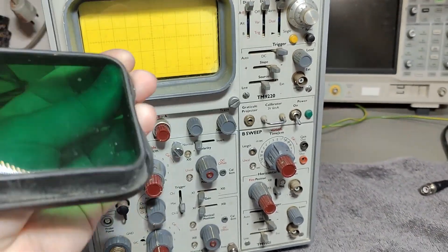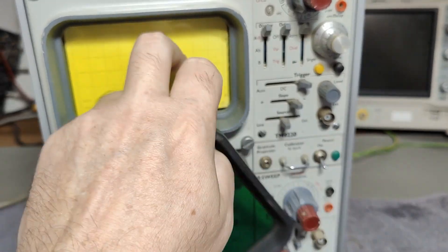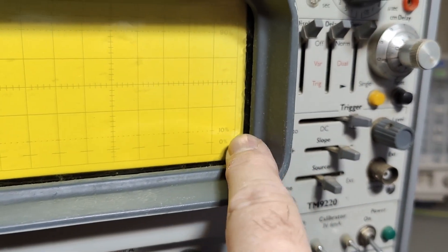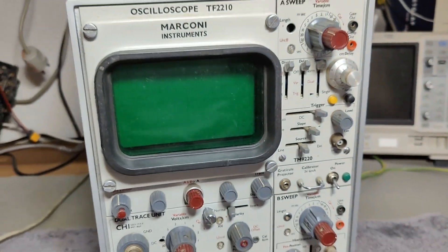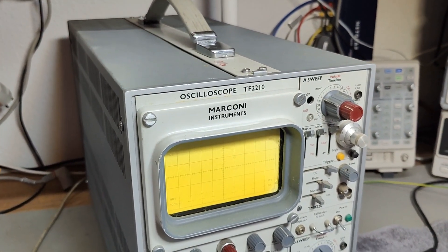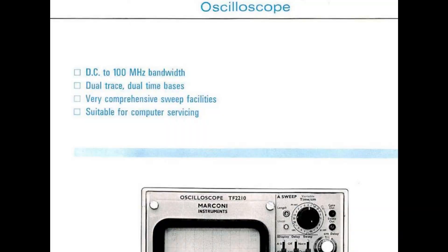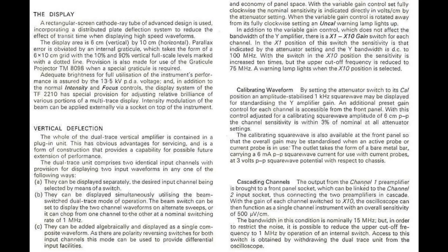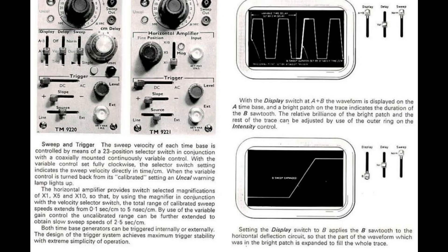You can take away the screen like that and then you have yellow — is that the phosphor that is yellow? I'm not super happy about what I see down here. This could reveal some bad things inside the CRT, so maybe it's completely dead. I need to open and do a visual inspection before I power this up, because I think this one was stored for a long time before I got it. I was lucky to find some information online about this oscilloscope, so I'll show some of the most important pictures here. Feel free to hit pause and read what they say in more detail.